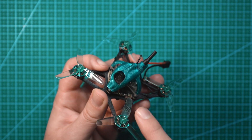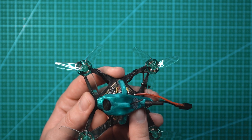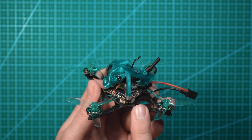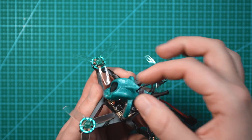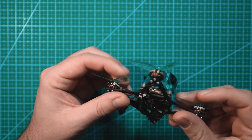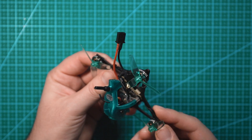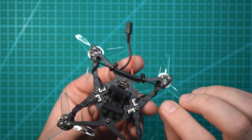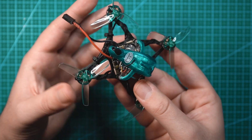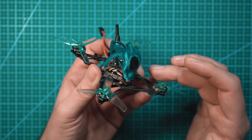The VTX built into this flight controller is capable of 200 milliwatts of output power, so we'll be able to get some decent range out of this thing. Even though I have the TBS version, the TBS receiver is attached to the sled, but regardless, you're going to have the 2.4 gigahertz ELRS receiver built into this board — this is the antenna for that. The camera is the Caddx Ant Eco. The frame seems pretty solid, it's carbon fiber and about 1.5 millimeters thick. I like how they have the motor wires wrapped around the carbon fiber arms to keep the wires tidy. The motors plug right in, so if you have to replace a motor it's relatively easy. The motors are Sub250's 1002 21,000 kV motors with tri-blade props.